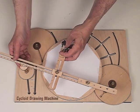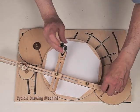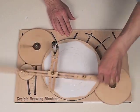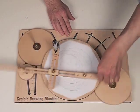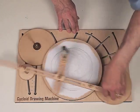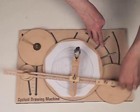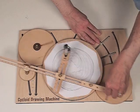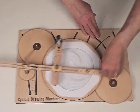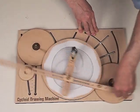We're going to put this down on our fulcrum slide, clip the pen, and let's see what we've got going on. There you can see this — instead of having a fixed fulcrum, it's going around and around. Since we have a 98 gear, it'll never come to the same point. Stop it and see — see this triangle forming here? That's because of our 40 gear making three passes with one pass of the 120 turntable.